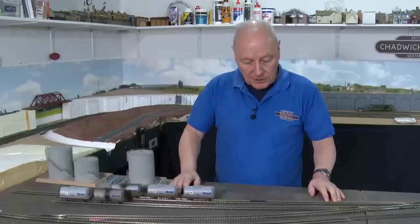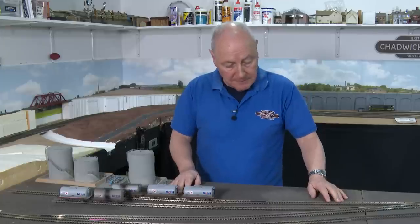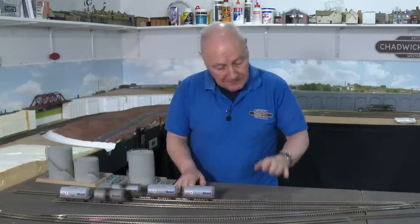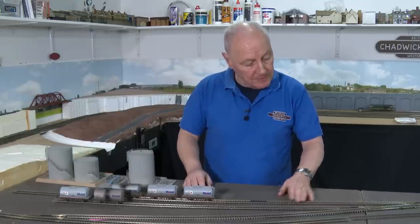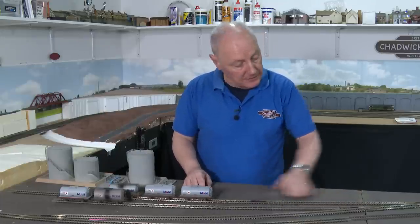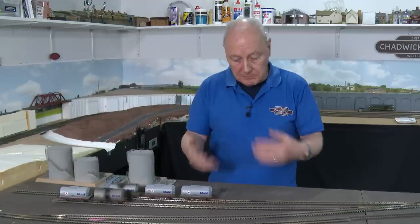Whereas if you've got a solenoid mounted underneath the baseboard, that's never going to happen because it will only energise when you press a button. Installing hidden solenoid uncouplers in this area might seem a bit of a waste of time, money and effort — but we've got to learn and move on. I've also got the idea that I might want to do it automatically within train control or perhaps iTrain. A train would come in, uncouple, leave its wagons, retire back, and later another loco might come in and pick them up automatically.